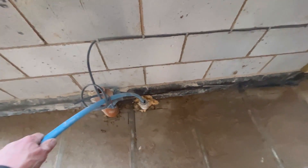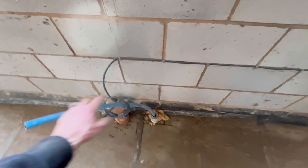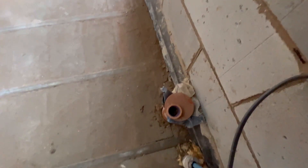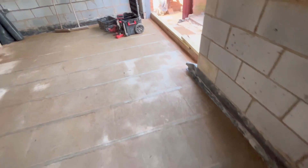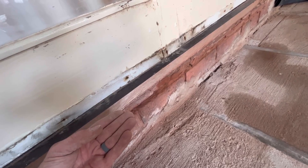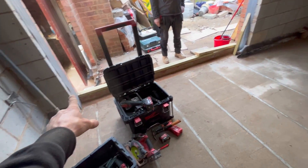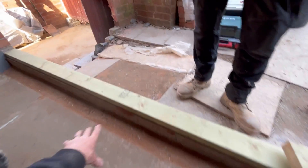I've put a bit of insulation behind this pipe just to pull it out so it's not against the wall — didn't screw it in, so that's ideal. You want it away from the wall, it pulls up into the back of the service void in the cupboards once you put the dab on. The floor level is coming up to about here, so I didn't want to risk leaving the pipe touching the screed. If it does touch when we check it, we'd have to make good all the floor again, so I thought we'd hack it off. It also gives us a reference to work to for our screed.